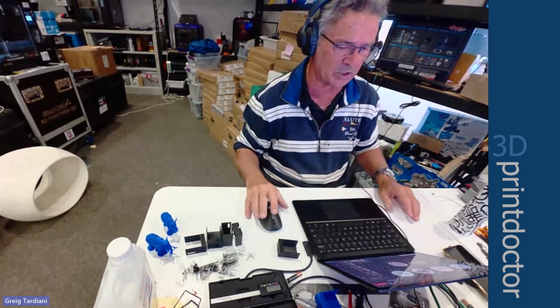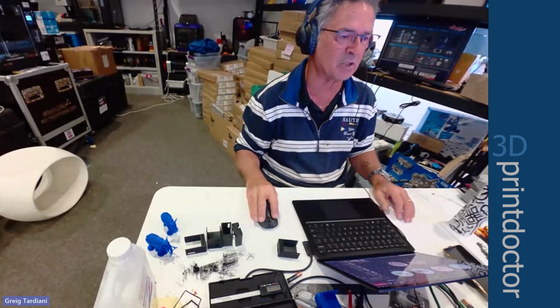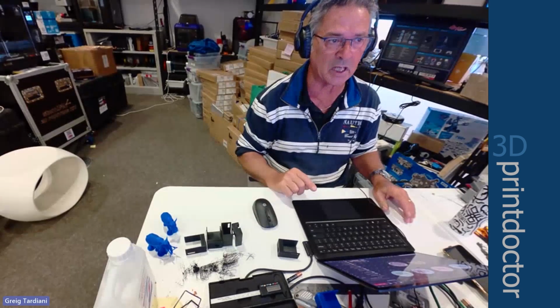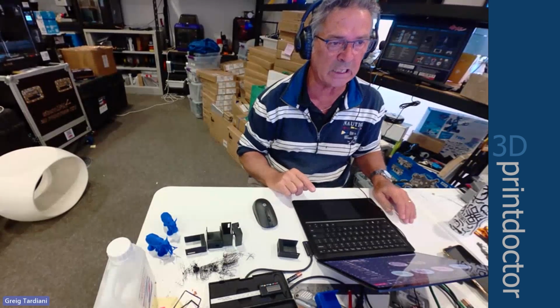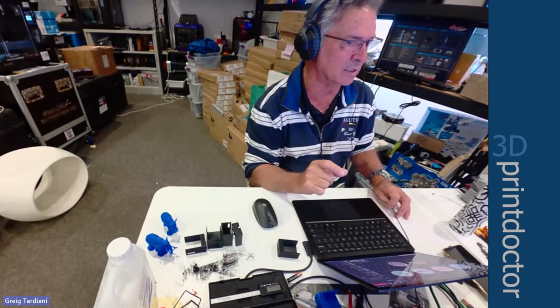And you do find you get a shift in the Z-axis occasionally, which can happen with STLs that have got some issues in them. So sometimes you've just got to play with it. But the elephant definitely needs supports, and I would just go auto supports with tree, give that a go. That ring, though, is not going to stick.